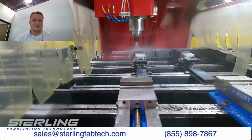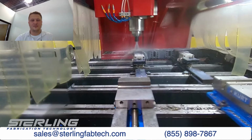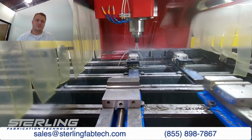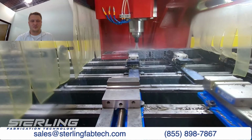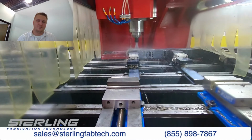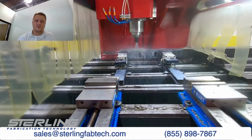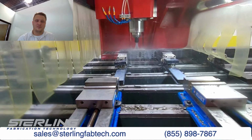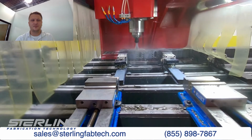What am I doing? The Kurt vices are solid machinist vices. If I'm going to be doing some heavy milling or really any milling at all, your Kurt vice or any machinist vice, that's going to be the route to go. Where the pneumatic vices that you had mentioned, if I'm doing some drilling, those vices are perfect, especially if this setup particularly is on the back side of the machine. It's just a simple flip of a switch and that vice closes up. I don't have to be leaning over the machine to put some torque down on that Kurt vise. So I have many likes about many different fixturing options. It's just a matter of what am I going to be doing in that machining process.